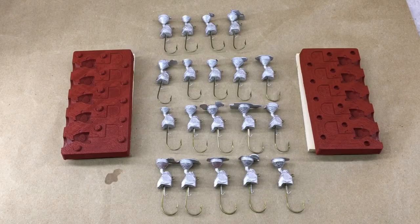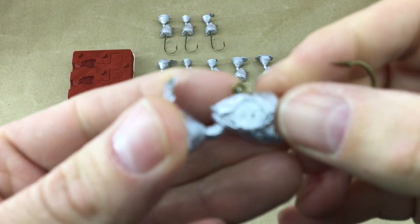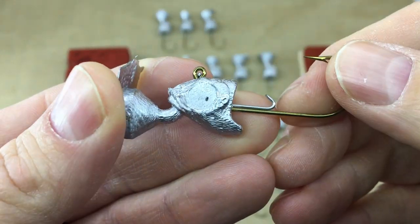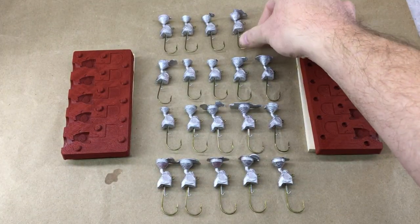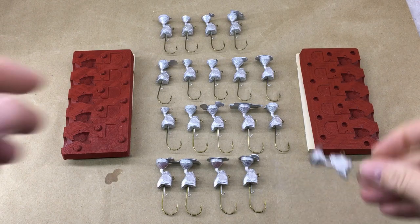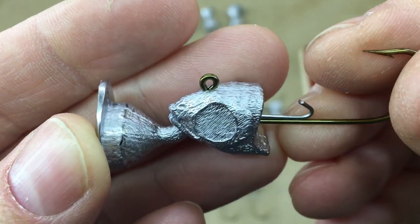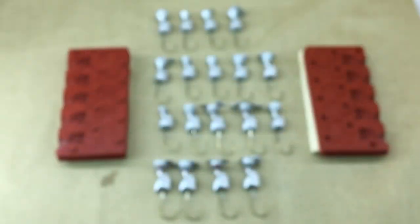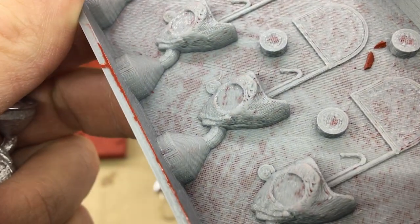So this is what I did today. I ended up doing four batches and got 19 good ones — only had that one screwed-up one. The first batch I did have some pinholes in the eye, which I think might be because the mold was cold. I know that makes a difference with aluminum; not so sure about silicone. But by the end they came out good. They do have a little wrinkly finish, which I think comes from the actual mold — you can see the 3D-printed mold has the same layer lines.